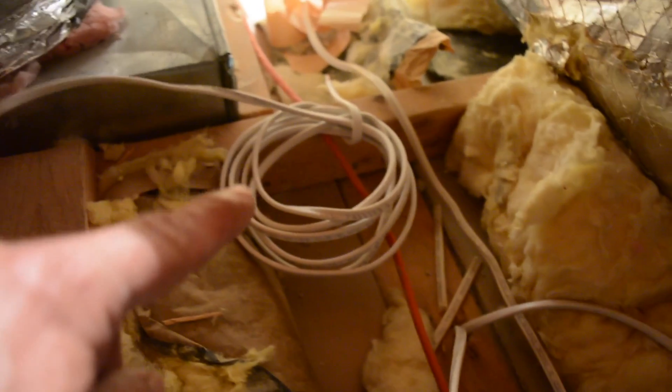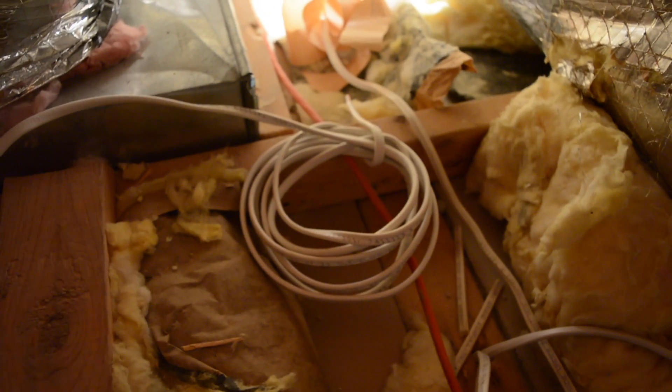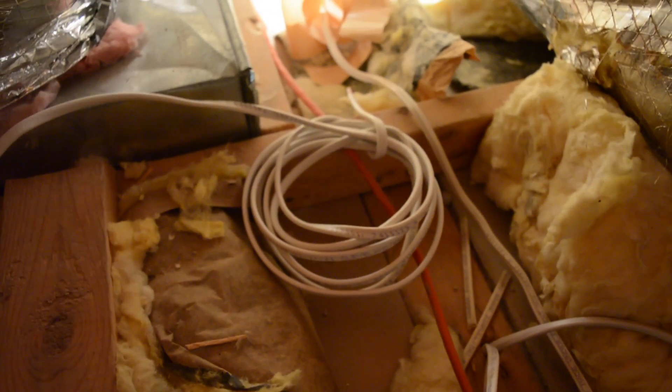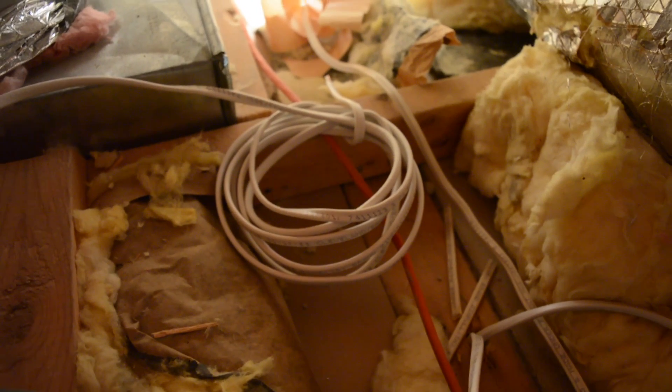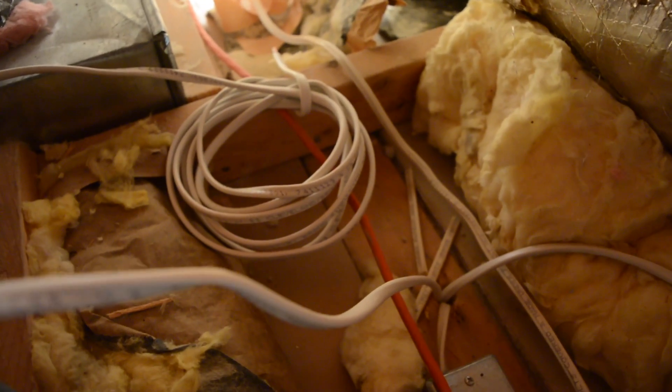All right, lucky enough I drilled it right. If you look down in the hole there, you can see the light coming in from that hole that I made — that's one of the reasons why I did that first. So now I know I'm right there. I want to show you guys quickly this wire coming up from my wall, coiled up here. This is a non-energized feed that I had actually installed quite a while ago for this purpose, in case I need more power up here or if I want to do those lights. Basically the same way — drill down to an existing light switch or outlet, maybe grab the power from there. That's going to be the hardest thing of this whole ordeal: where you're going to get the power from.